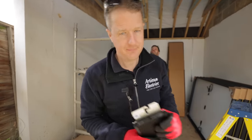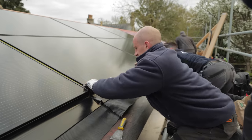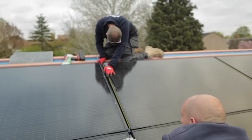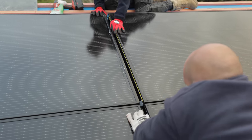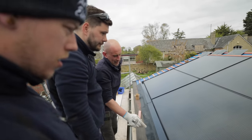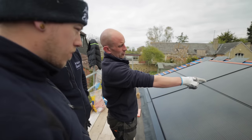When these connect they only output one volt per panel until the inverter is actually connected, so we can safely run all the DC cabling without worry. Keep pushing - finish it here where the yellow ends. Start from one end, tilt it so it angles down a bit - that makes it easier to push in.